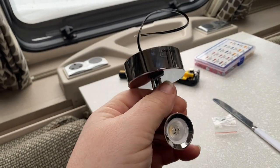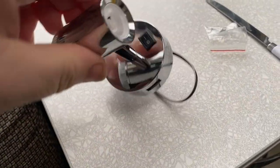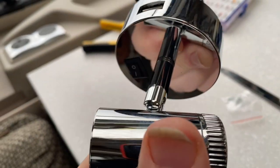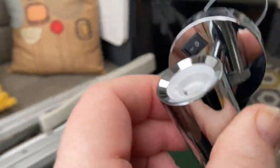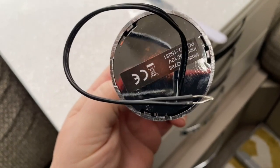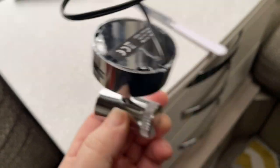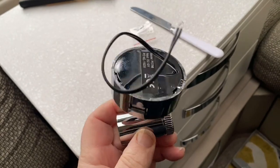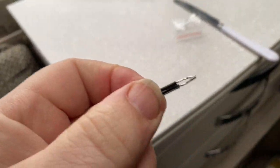The design is slightly different on this new spot because the screws, as you can see, they're not visible like the old ones were. In the new one the screws are not visible because there's a plate on the back that you need to remove, and it's the plate that you attach to the cabinet. Then this slots on a bit like a bayonet fitting in an old light bulb — it sort of slots on and then twists into position. Also notice the terminals don't come with a spade or crimp on, so I'm going to have to do that now.